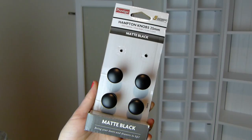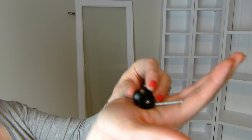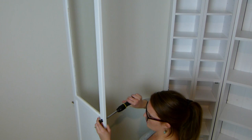For the cupboard doors, I got these awesome doorknobs from Bunnings, which I will link for you in the description box below. The knob has a little burr on the underneath side, so when you screw it on, just make sure that the knob stays still and doesn't spin around, or you will end up with a little circle drawn in your new paint. They also have the snap-off screws, so you just need to measure the length that you need and then snap it off at the length you want with some pliers.